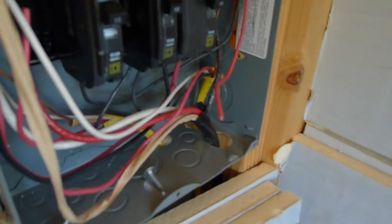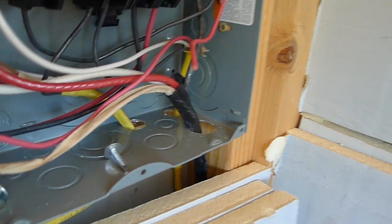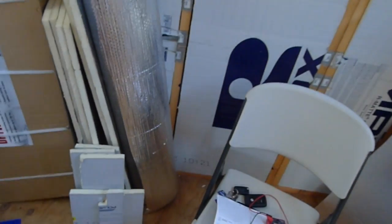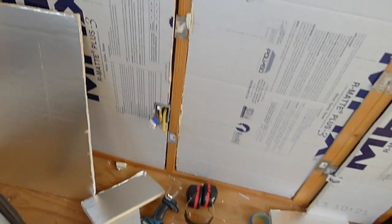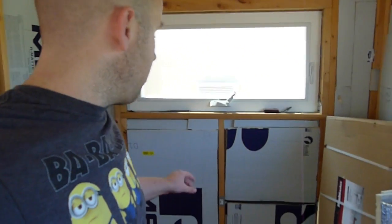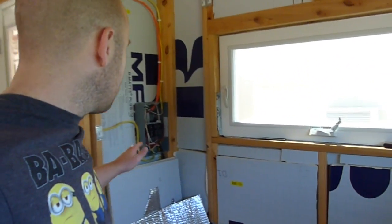So for instance, the wire that's yellow in the back on the right there — that one is the circuit for the lights in here, the outlet down there, the outlet over here, and the light up there, and it continues down and goes to here, to that outlet, and it also goes up to this light. So that's the whole circuit. Basically, what I will be doing is removing an outlet from that location and tying — well, I'll test the hot and the neutral from there. I'm going to tie them together and test them back at the breaker box to make sure that they do indeed have continuity all the way.